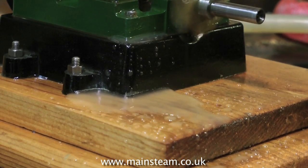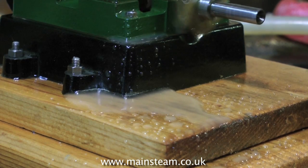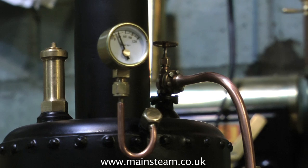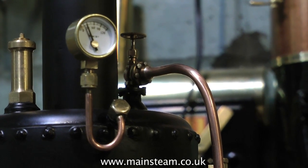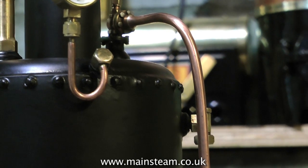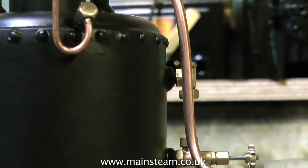If you're using an engine like this in a model boat, you will need a condenser oil trap to trap the water and oil mixture to stop it polluting the lake. The problem is the condenser will fill up far too quickly because you're getting too much water. Here the boiler is also running at low pressure, and the lower the pressure, the wetter the steam. The higher the pressure, the higher the temperature of the water and therefore the steam temperature is higher.